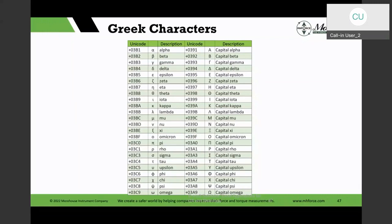So now, the RANDBETWEEN function that Tony pointed out is not a very good function, because RANDBETWEEN will just give you the integer values between the top and the bottom. So I would refrain from using it. It's kind of nice if you're doing a lottery raffle and you've got 32 participants and you want to pick a random number. Yeah, that's good. But for what we want to do in measurement uncertainty, that's not a good function, okay?